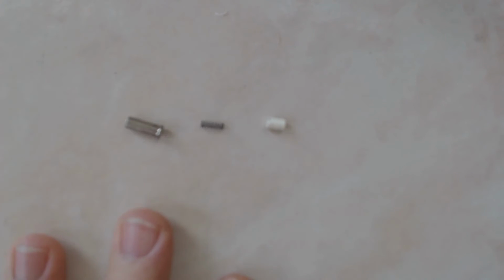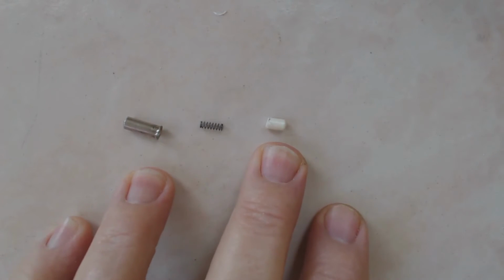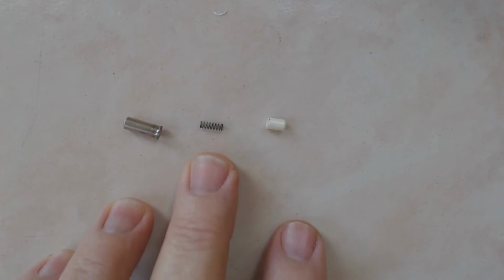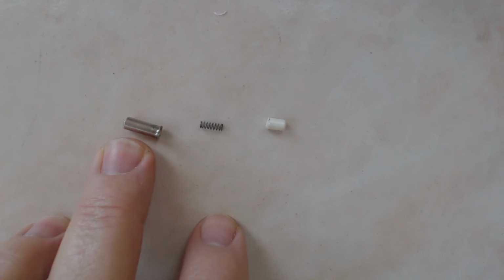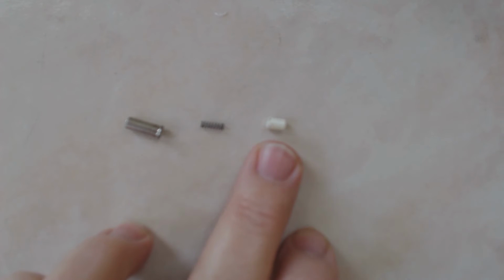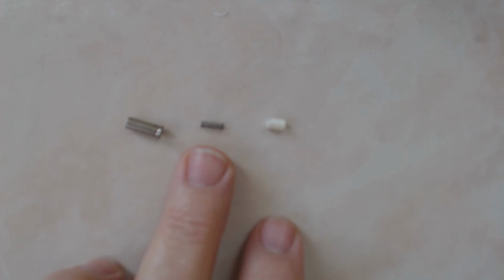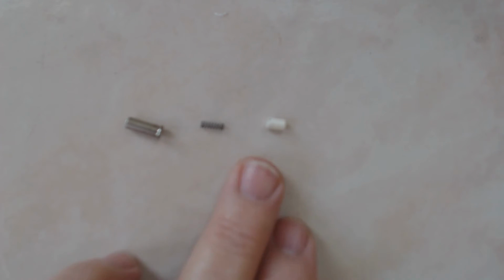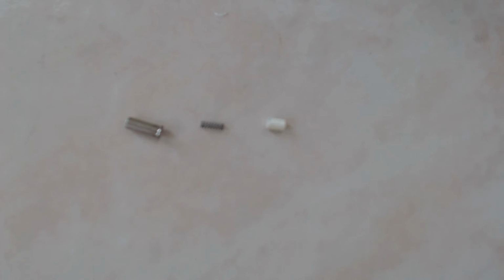Here's the components of my power button. The cap and the small plastic piece came out of an old ballpoint pen, the little spring I had in my junk box, which works real well. That way, when I push in the cap, I don't hard mash the button on the LattePanda and run the risk of breaking it. This gives me a little bit of cushion with this little spring here. I may make one for the reset later, but right now I decided I'll just go ahead and make the power button operational and wait a while on the reset button.